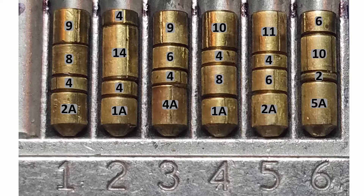Here are the original pins that came out of that lock when I was able to pick it to control. These are the key pins — they're labeled. My friend Josh labeled all the key pins and all the operating pins according to the actual specification. Above those we have master pins — notice we have a master pin in every single chamber, meaning this is a fully master-keyed lock. Above that, these are pins called control pins, which determine the control shear line according to how the bitting lifts the pin stack.